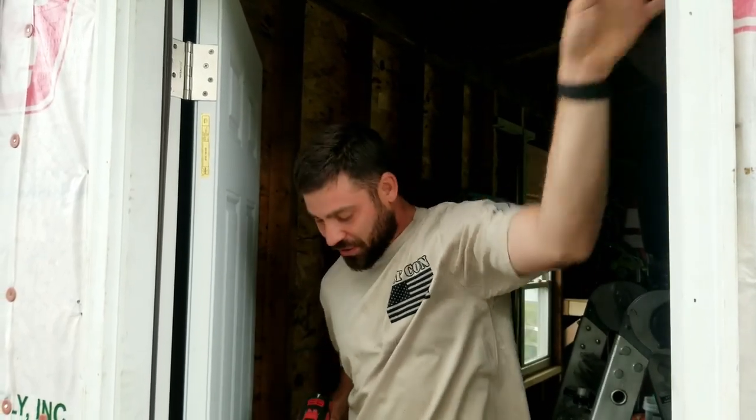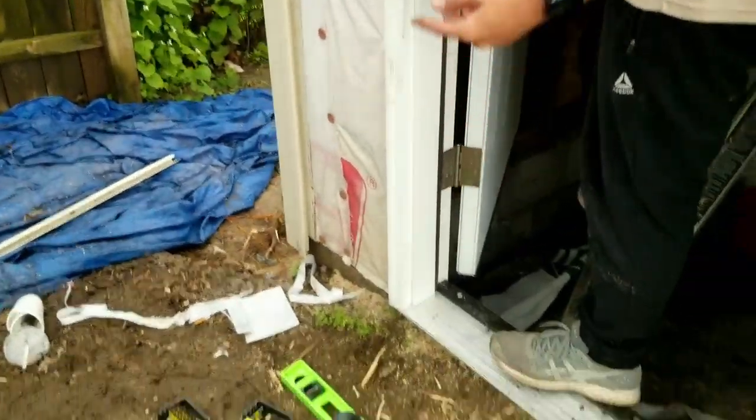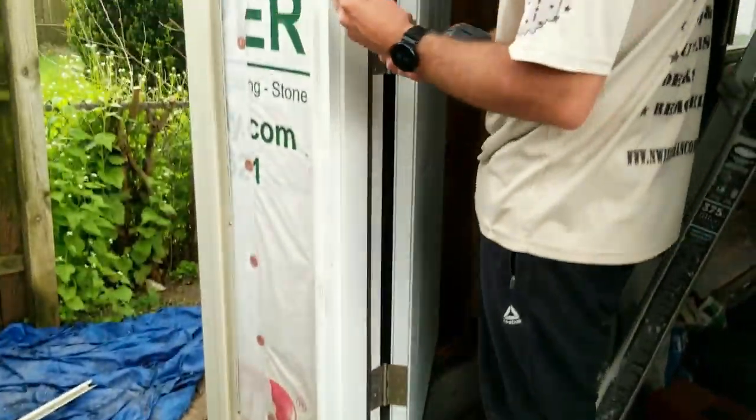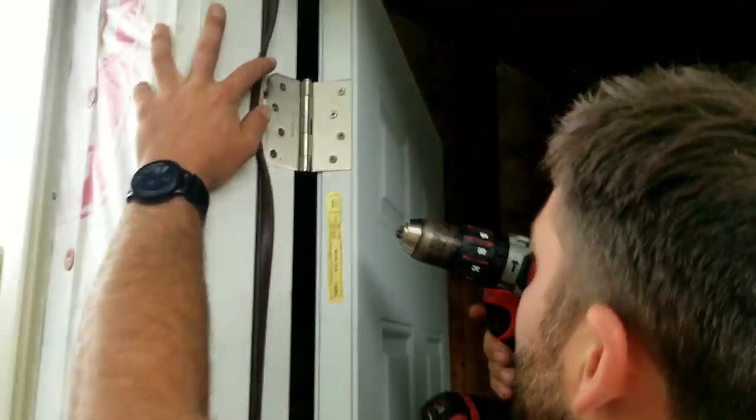What's up y'all, this is Zach with Veteran Construction. We've got a strip screw here — as you can see, it was kind of getting installed with a too-small bit and it's kind of at an angle, so it's a pain. I tried using this Masterforce drill already, but it doesn't have quite as long of a point as these Milwaukees here, so I'm going to show you how to get this out using this little drill trick.